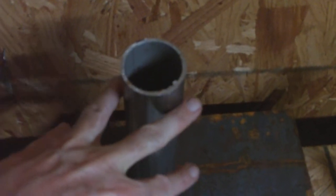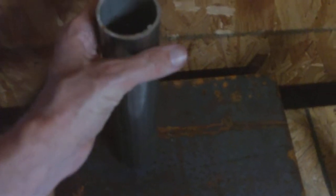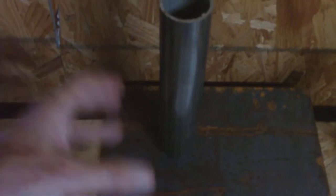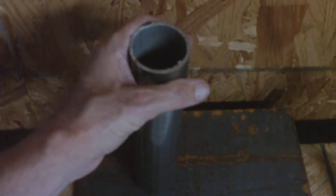The pipe itself will sit in bearings. Before getting that far, I'll need to do some welding — cut the two steel plates to exact dimensions, weld them together into basically a box, then weld the pipe to the steel plates so both the plates and the pipe move and rotate together. The bearings on the outside will allow the whole hub to rotate, mounted in a new structure I'm going to put together.